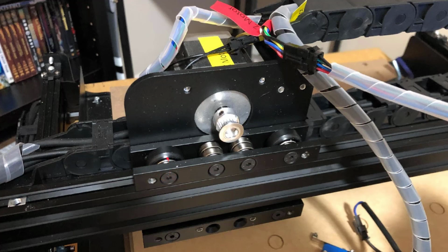Same thing. You're going to have the wheel and 2 washers, slide those out, insert the screw, fit the first washer over it, then fit the wheel on, push the screw through just to the edge of the other wheel, fit the washer in there, slide it in there. If you loosen all of this, you'll have a little bit more room to slide that washer in.